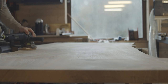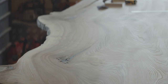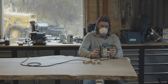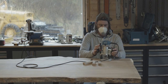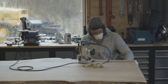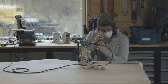Now working on the top side of the tabletop, I do my normal sanding routine to get rid of the cutter marks, then use some CA glue on any remaining small defects, and install the remaining bow ties. This crack is left open since it looked pretty cool, and it made sense to incorporate bow ties into the design. The Makita router has horrible dust extraction compared to the Festool — I am sitting in a cloud of dust. A good tip: remove sawdust from your eyes by sucking it off with a vacuum instead of rubbing it with your hands. But don't go too close or it could suck your eyelids right open — it's a little bit uncomfortable.